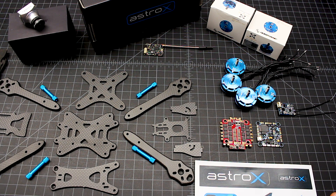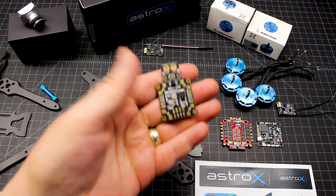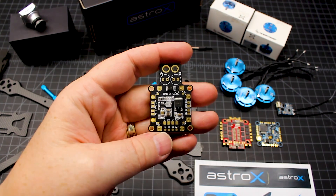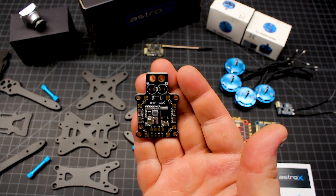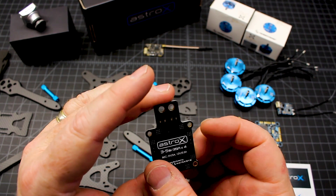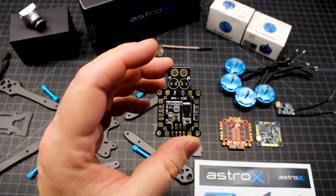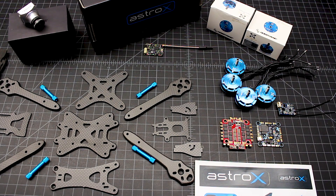At 4S I think there's better motors out there — I think the F40 V3 is a better motor on 4S — but once you put some voltage in these, they just scream. So that's what we're doing: 5 and 6S. This frame does come with a couple of nice battery straps. We're not using it, but it does come with a really nice PDB that's laid out really well and built really well. That makes a difference in overall quality and how long it's going to last. None of these components are going to come desoldered. You could run up to 5S on this PDB — 5 volts at 2 amps, 12 volts at 0.5 amps. Good PDB, comes with an XT60 and all that stuff.